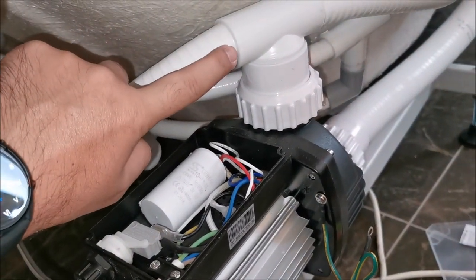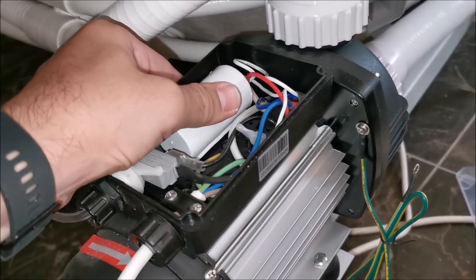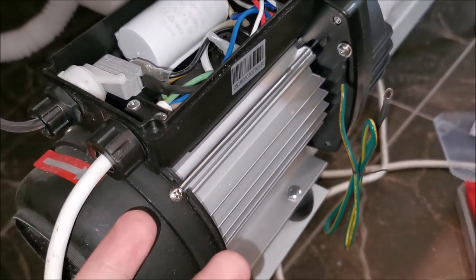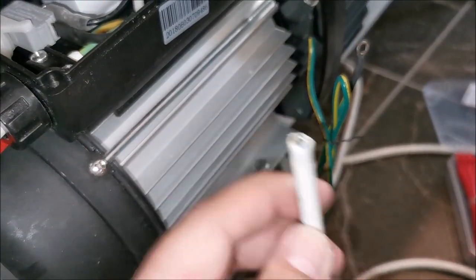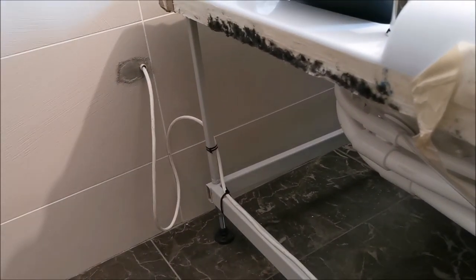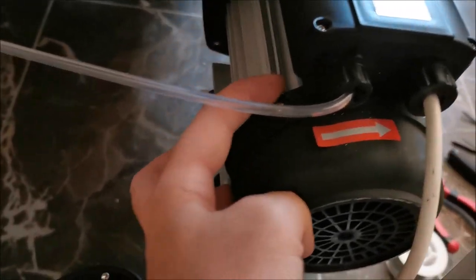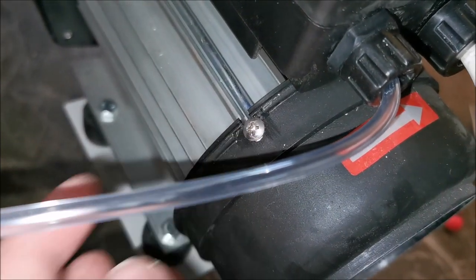If the seal ever fails, that 10mA differential fuse could save your life. Make sure you have it, and make sure your earth/grounding connection is good in your house. We also have this ground wire but I don't have anything to connect it to — in our situation the ground is provided directly through the wall connection. Our wire is zip-tied to the frame and going into the wall, and I will also seal that hole.